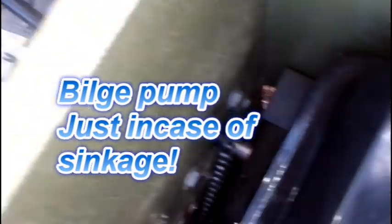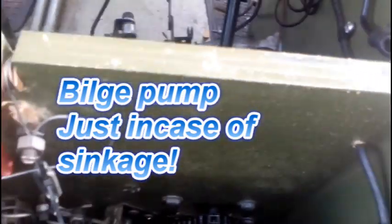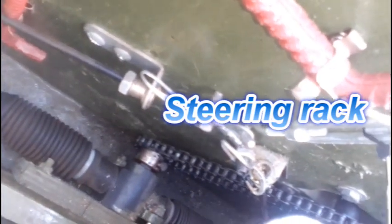We have the steering, which I've made just again all out of go-kart stuff. We've got a shaft there, a couple of universal joints, and another shaft going through this front bulkhead to another chain, which goes down and drives a more sort of heavy-duty go-kart steering box. These cables are for my front brake cables.